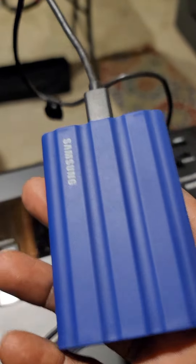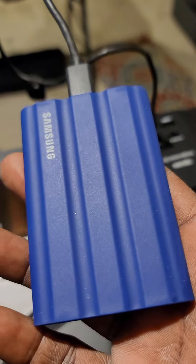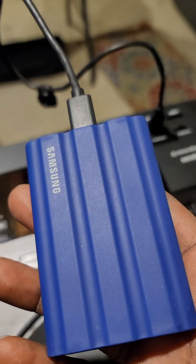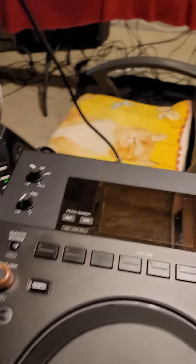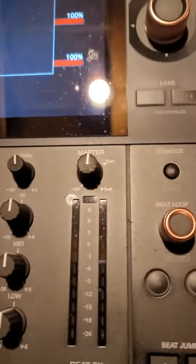Once you download it to your PC, transfer it to your USB drive. I transferred it to my drive that got my music on it. Once you do that, you're going to power off the Opus. Unplug all the cords from the back of the Opus — no cords for the computer, only the power cord and speaker cords. Hold down the beat sync and the master button while you power on the Opus.